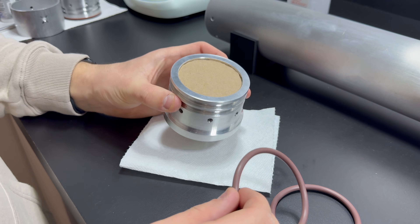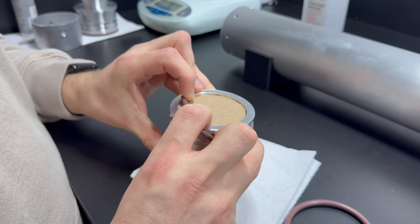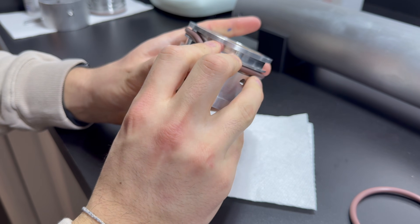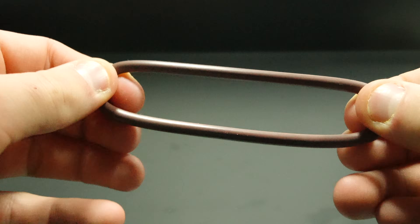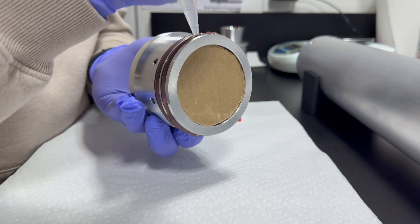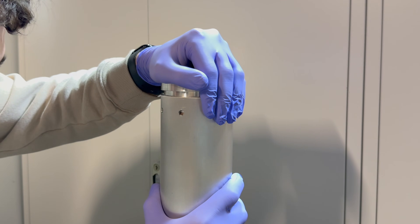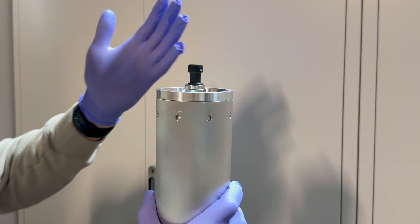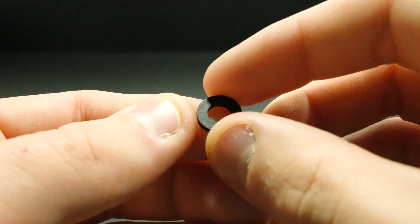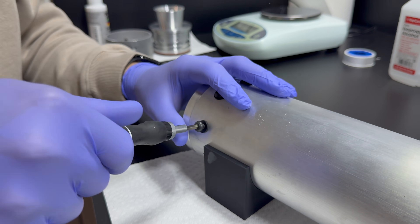I also add a small cardboard disc to prevent the grease from leaking out before the motor is fired. After that, I install the bulkhead's O-rings. Both the bulkhead and nozzle use two O-rings — a primary seal and a backup seal. If both of these O-rings were to fail, the motor would be destroyed, so sealing it is extremely important. Specifically, these are FKM fluorocarbon O-rings, built to survive extreme temperatures. Once the O-rings are installed, I add a small amount of lubricant to help slide the bulkhead into the casing. With the bulkhead fully installed, I add eight radial bolts and use plastic washers under the bolt heads, which prevents the bolts from digging into the soft aluminum casing when tightened.